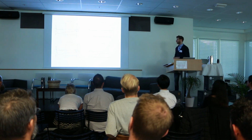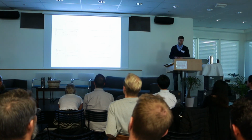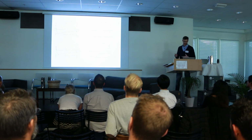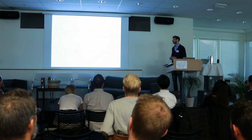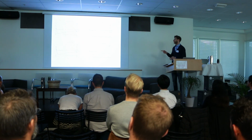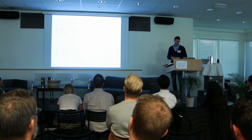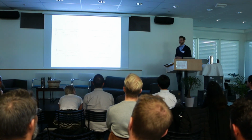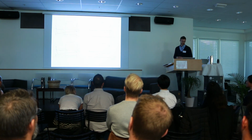Right here we had first crack at 4 minutes and 43 seconds with a deviation of 4 seconds. But what's more interesting, because of course I can just say that first crack happens at this time, is seeing the time corresponding with the bean temperature here. And here we have a bean temperature at first crack at 184.1 with a deviation of plus minus 0.3 degrees.